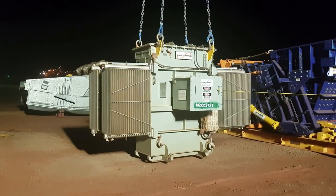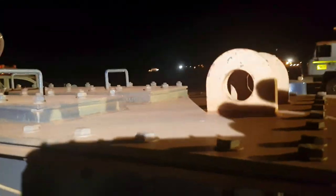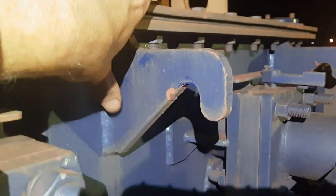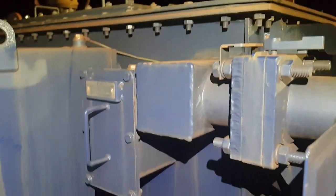Here's a perfect example of tricky transformers in 2021. This transformer has yellow markings — you'd think yellow means pick-up lugs, wouldn't you? But these aren't actually the lifting lugs; these are the lugs for the lid. On the diagrams that come with these transformers, the actual lifting lugs are these welded lugs here on the side — those ones, not these ones. So with transformers, if they've got diagrams use them, use the side lugs, and you can tell this part is the lid.